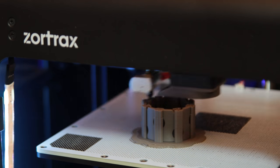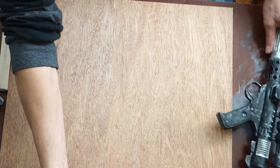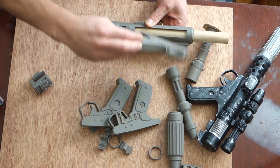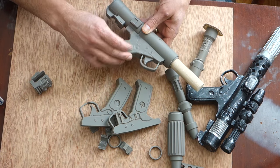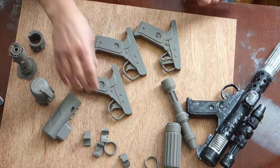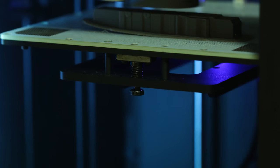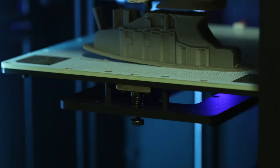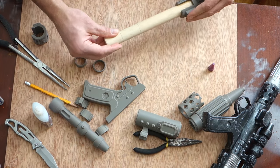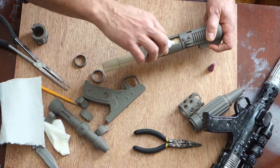You can see in this vent part that there's a lot of support material. That was another problem with the first print — I had to dig that material out, which was a little bit problematic, but doable. There's the first version and here's the second version. As with any 3D printing, I had some misfires. A couple pieces didn't print correctly; I had to do the handle three times because of the trigger guard. This piece actually pulled off the print bed — I happened to capture this one. Remarkably, the rest of the handle still printed but it was skewed and unusable. That's part of the nature of 3D printing. This is a really fantastic printer; I just hadn't cleaned the bed in a while, so I think that was my fault.